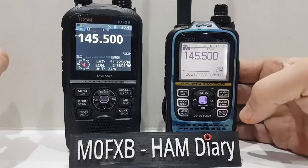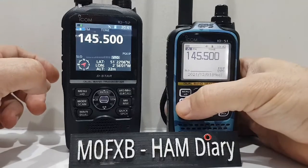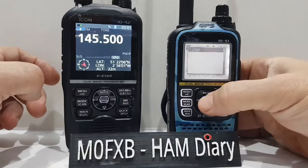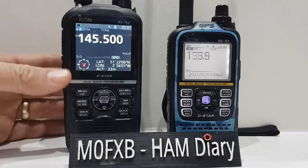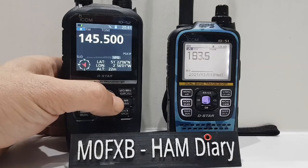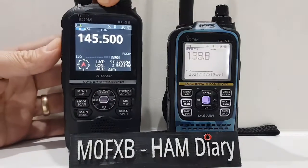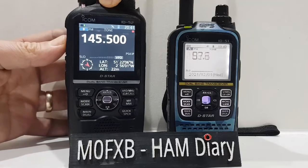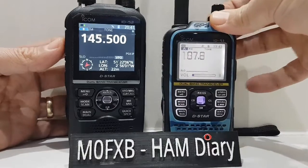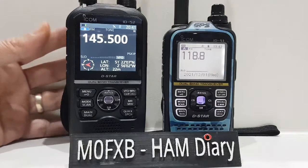So on the 51 to scan for tones — hold again, it's very similar to the 52. Hold down the mode scan button, go all the way to the bottom, and then with the little blue toggle in the middle, push that in. Look, it starts to scan. And now we're going to TX. I'll just make sure we're in low power — super low. Low power on the 52 is hold down low, that's the right hand toggle, and look you've got super low. Let's TX. See it's starting to slow. There you go — sorry about the feedback. We'll do it one more time. There you go — 118.